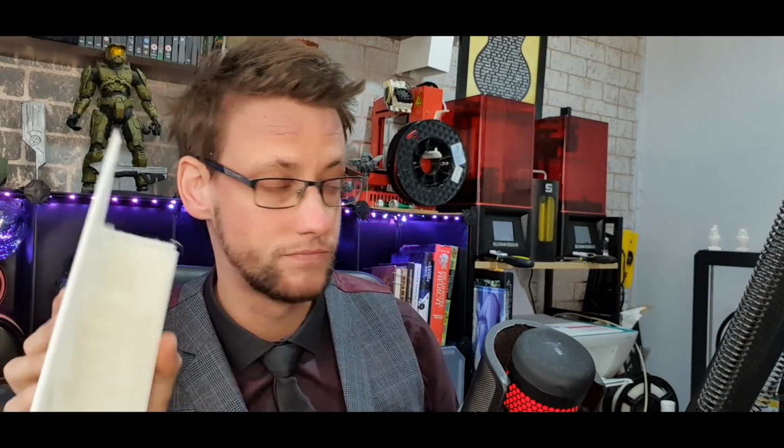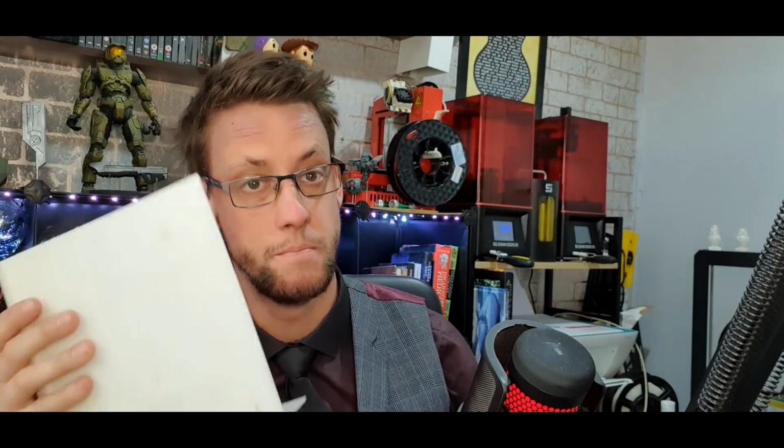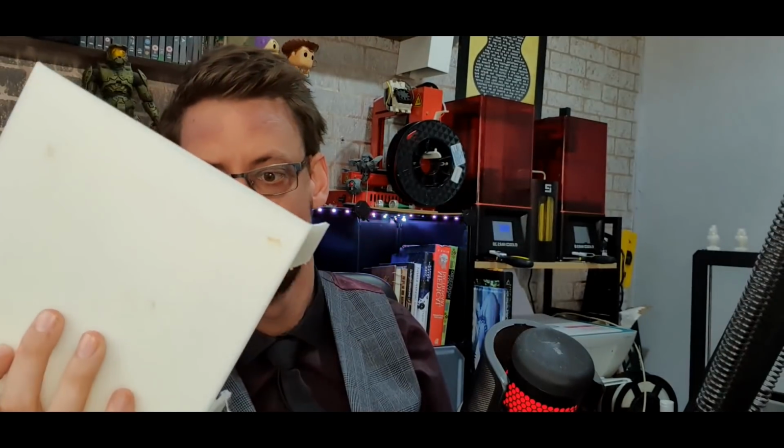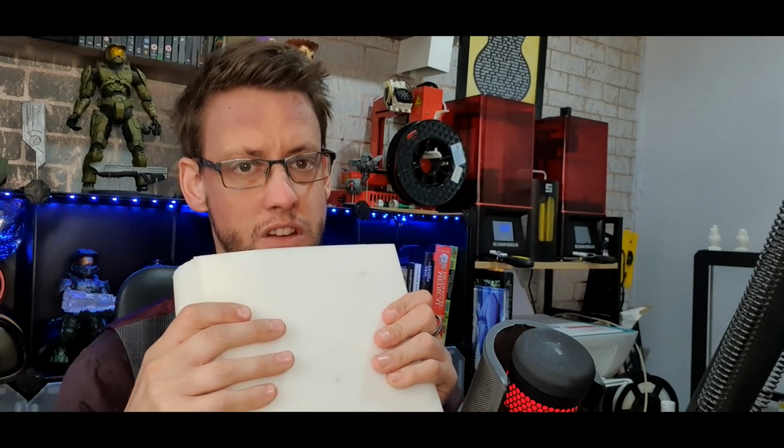Probably my fault. I had the printer positioned too close to the wall when it first started up, and the print bed bumped against the wall, and the printer laboured against pushing its own weight against the wall from the print bed. I realised what was happening quite quickly, and I adjusted for it and dragged the printer away from the wall a little bit more, but I think at that point it had pushed the calibration out effectively for the print, causing it to warp, or to print askew. Not ideal, but it at least proves that it's nice and tough.